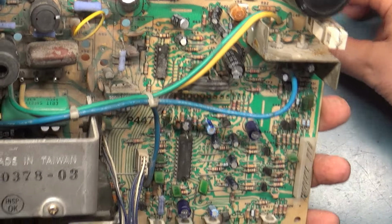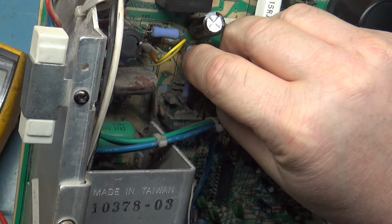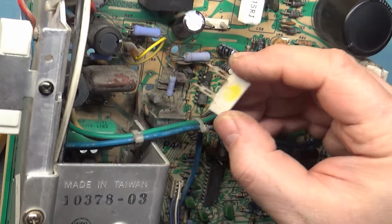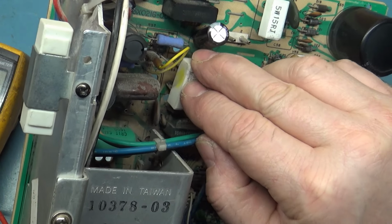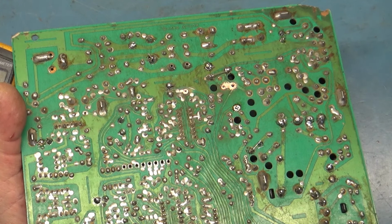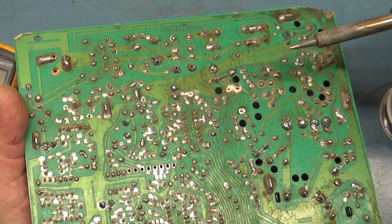And now you'll get to see what this stuff looks like when it's done properly. So R101 going back in. Nice. That's good. R89. Make sure I don't put R104 back in there. Okay, that's good. I'll stay there. And we're gonna have to tack this in place. I'm gonna turn my fan on here, get loud a little bit. And we're just gonna add a little solder to this and just tack that in like so. All right.